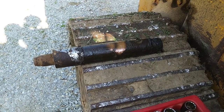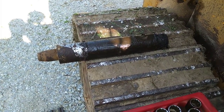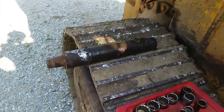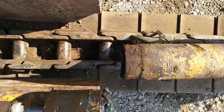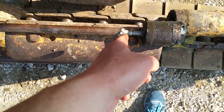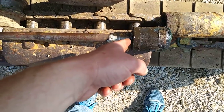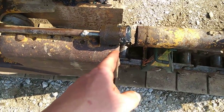I should apologize — the camera work is really shaky. Anyhow, the rod pulled out separate. I didn't get lucky — the piston came off the end of it. So I pulled the rod out separately. According to the book, there are threads in the end of the piston. I took a half-inch bolt — half-inch thread, three-quarter-inch head size — and welded it on to a piece of rod, poked it down in there. It only caught about half a thread but it was enough — I got lucky and it pulled the piston and everything right out.